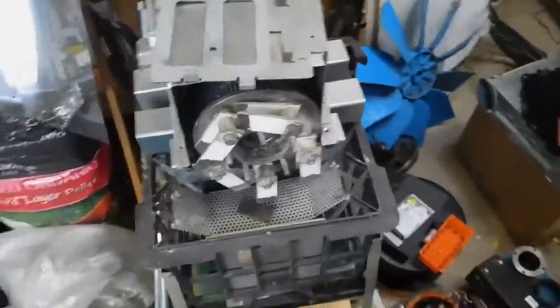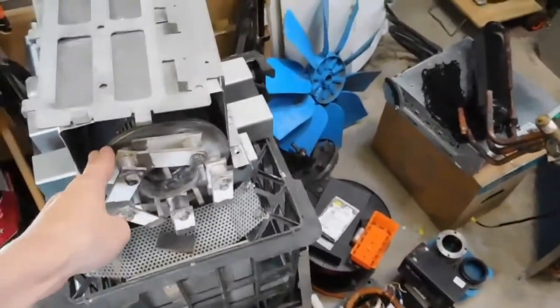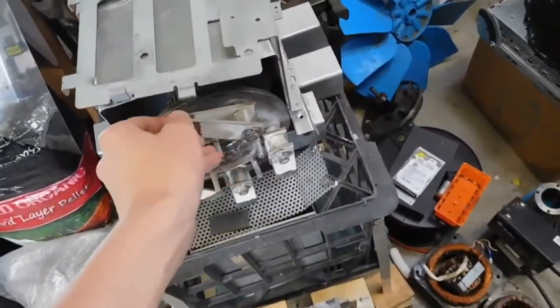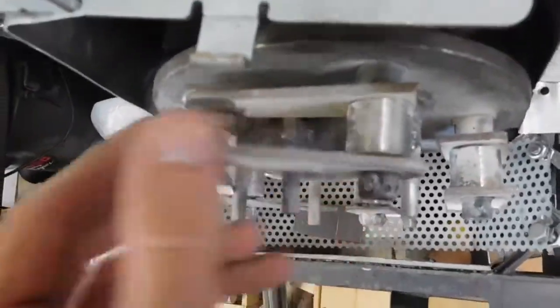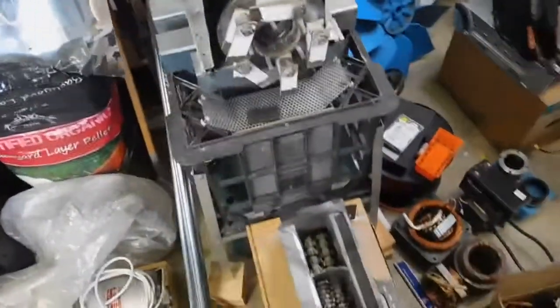And the hammer mill as well. Whoops, running out of battery. So, apologies if it cuts out on me. Slowly I'm going to be renovating this and welding some little bits of mild steel to the end, which will harden. I'm going to oil harden it as well. And hopefully that'll extend the life of this, make it perform a bit better, as it has significantly worn down after all that shell grit that I ran through it. But other than that, this thing works bloody brilliantly. It goes great guns. There's another part of it over there, the front case. But there'll be a video on that at some point. I can't guarantee when, but yeah.